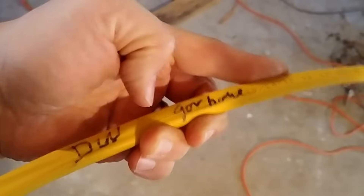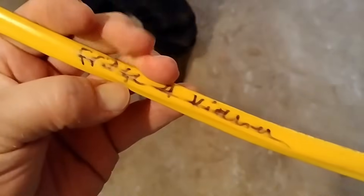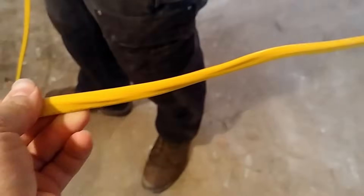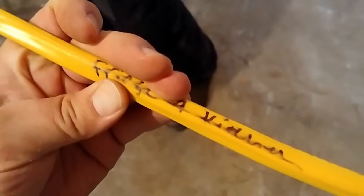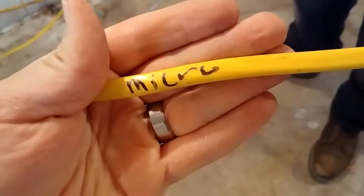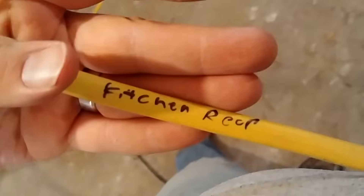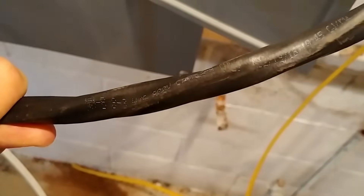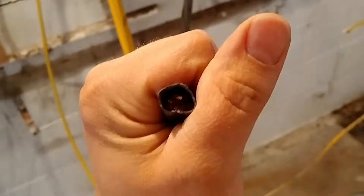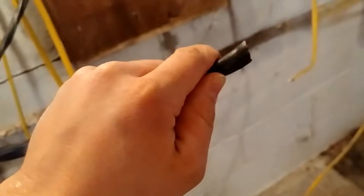This particular cable is doing both the dishwasher and the garbage disposal because it's two circuits in one. Now this is another circuit that is a 12-2-2 cable, and it is for the fridge and kitchen — so a dedicated circuit for the refrigerator, and then one of the kitchen general circuits. And here we have a regular 12-2 circuit that's for the microwave, and this is likely the second kitchen receptacle circuit. And this is an 8-3 with ground cable, so that means it has three current-carrying conductors inside of it and one conductor for ground.